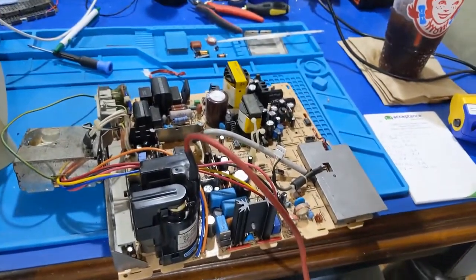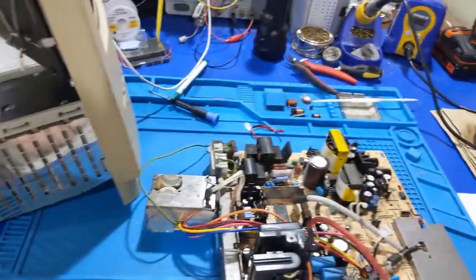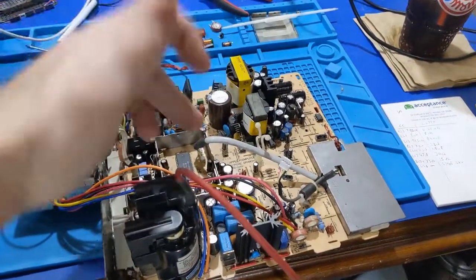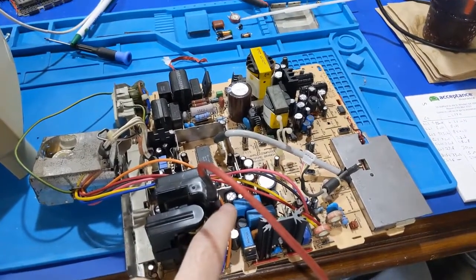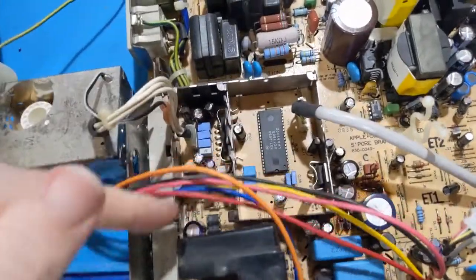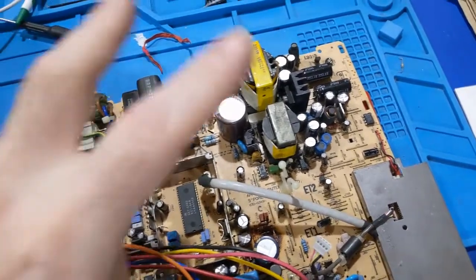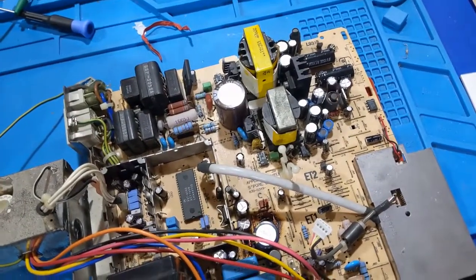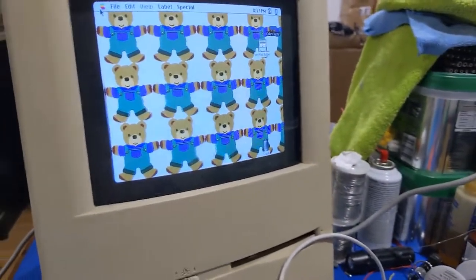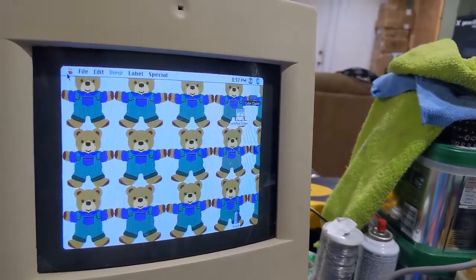So if you're running a 640 by 480 Color Classic, like if you're going to put a 575 board in there or something, it makes more sense to just redo this Color Classic board to match that of the 550 board. So move all these components over, do something with the flyback, move the flyback over, change all these other components out, and modify this stuff over here to get it the correct way. So anyways, let's try this thing out. So we're back up and running, and it didn't make any difference in the width, really. It did.